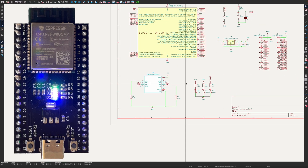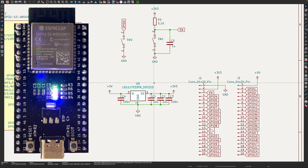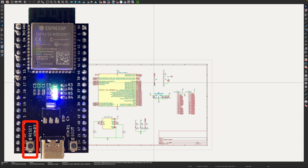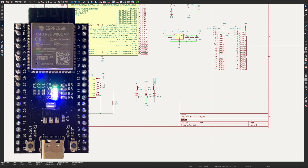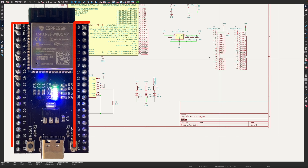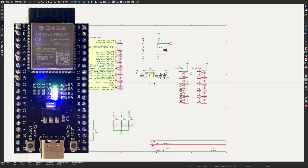It just plugs straight in. Our board is very, very simple. We have a voltage regulator, so we take the 5 volts from the USB and turn it into 3.3 volts. We've got the decoupling capacitors on the input and on the output. There's the reset button and then we've got some LEDs just to indicate what's going on: a 5 volt, 3.3 volt and one hooked up to a GPIO pin. And then we've broken out all of the pins onto a header. So it is a very basic dev board.